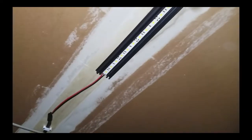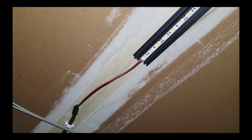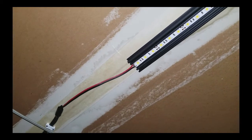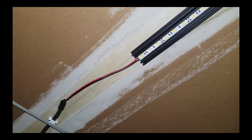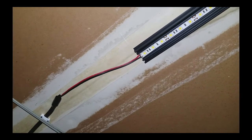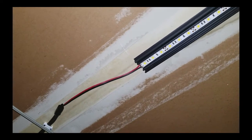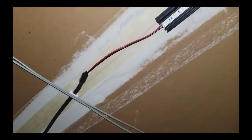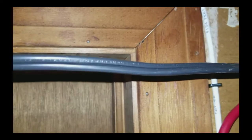This is better than the uneven and variable surface you see here with the sheetrock and mud joints. The LEDs are wired with a couple of different wire types. Soldered directly to the strips are some thinner leader wires that came with the strips. To them I spliced some heavier cable that can comfortably handle the higher currents required by the LEDs. These strips run off of 12 volts, so at 72 watts that means 6 amps of current will need to run through that wire. Thicker gauge will mean less voltage drop and thus less wasted energy. I used 14-gauge landscape wire since it has a nice thick insulation and can comfortably handle the 6 amps.